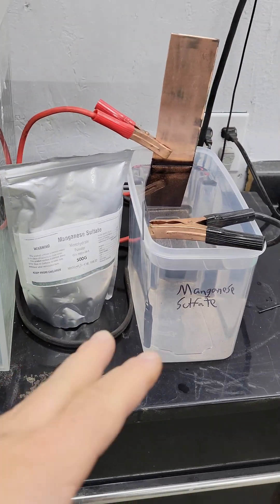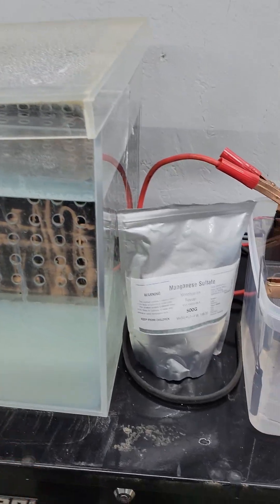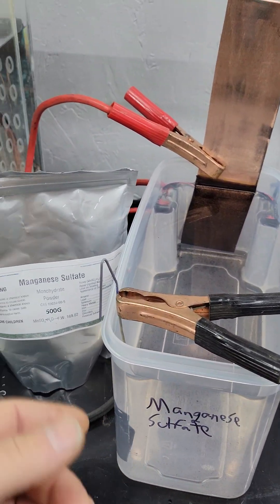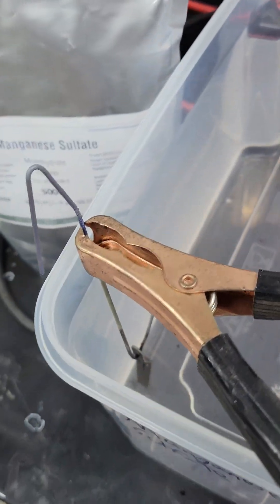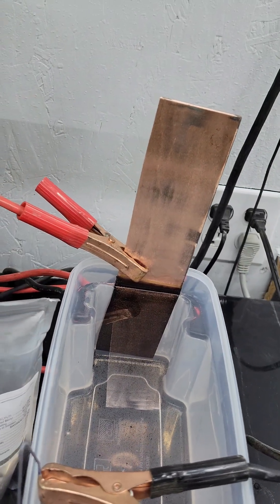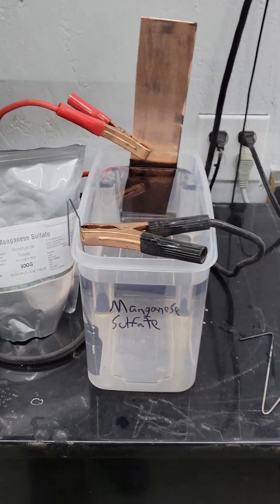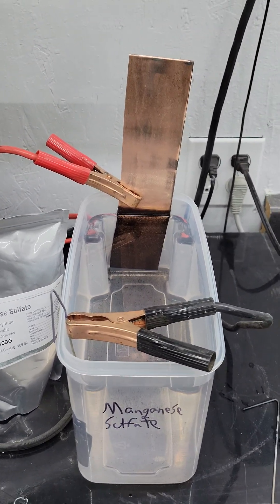Now if we want black, we have a whole new process set up for that. Instead of using trisodium phosphate, we're using manganese sulfate. Same setup — this is somewhat temporary, but basically it's just a Tupperware container. Some titanium wire on an alligator clip, I've got a pocket clip down in the solution, and then just the copper plate as the cathode — I always get anode and cathode backwards, so positive, negative, whatever it is. Realistically, if you put them on backwards, they just won't anodize, so you just swap them around.